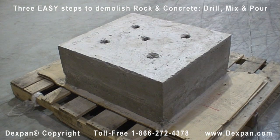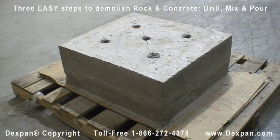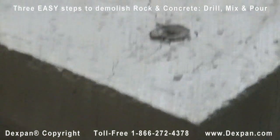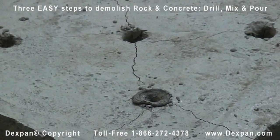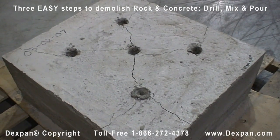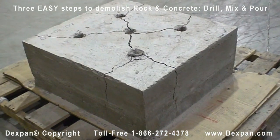Dexpan cracking or breaking time: properly drilled and mixed, cracks may appear after two hours of filling, depending on ambient temperature, humidity, and rock or concrete hardness. Give the Dexpan slurry 24 hours for best results. Although the Dexpan slurry may look dry on top, it does not mean it has stopped working. As you can see, after six hours, hairline cracks appear in this concrete block filled with rebar. Tip 1: well-designed hole drilling patterns will minimize consumption of Dexpan by cutting into desired sizes. Just 15 minutes later, cracks are getting wider and deeper. Tip 2: to ensure success, Dexpan needs free space to expand to.